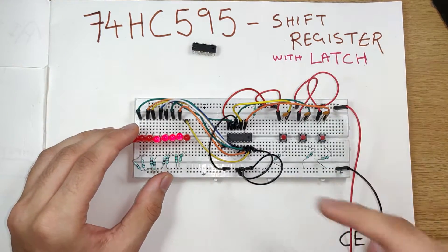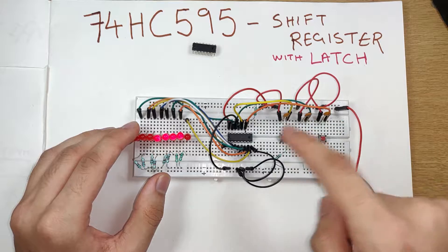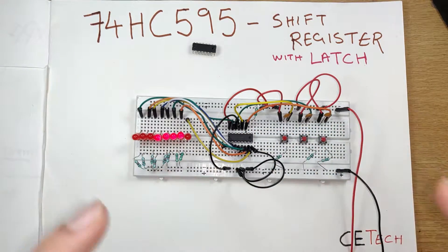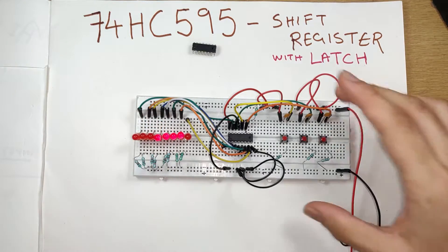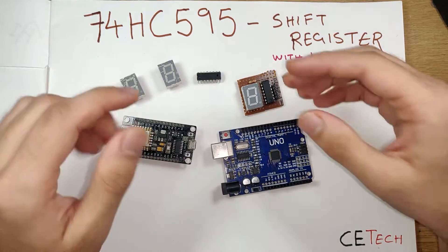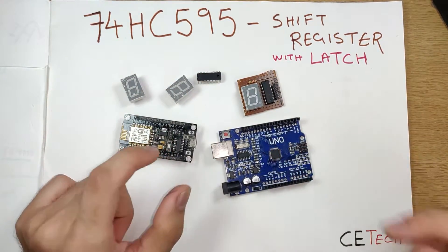You can cascade many seven segment displays. To understand the concept of shift registers and latch, we'll be taking a look at the circuit wherein we'll be controlling LEDs using the shift register manually, which will make our understanding more clear. So if you're interested in that, stay tuned — we'll be understanding how the 74HC595 works and you can use that with your projects.